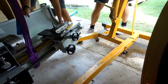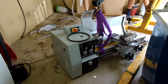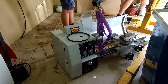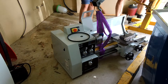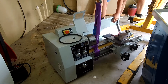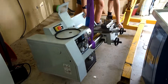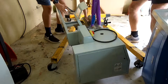For the CNC plans, I'll be using NEMA 23 steppers with a 1604 ball screw on the main carriage, and for the cross slide it's a 12mm ball screw. I'm planning to use a Centroid Acorn controller. They weren't the cheapest but they certainly looked like they're the best out there and the easiest to implement.